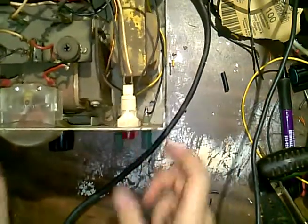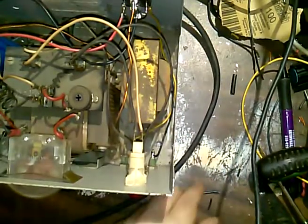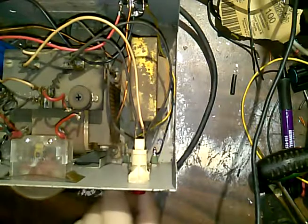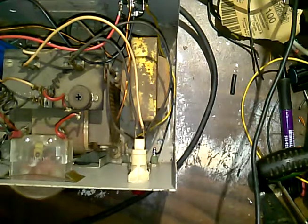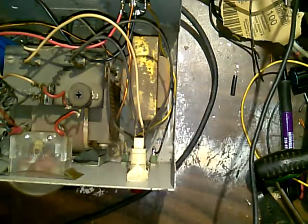It's higher capacitance, higher voltage capacitor. Should provide years of service. So yeah, this video's done. AC DC now works. There appears to be no AC on the DC side, which in theory means no ripple. So this would be good for bench use. I'm going to take my brush after I turn this off, kind of clean all this up a little bit, and see about painting the case.